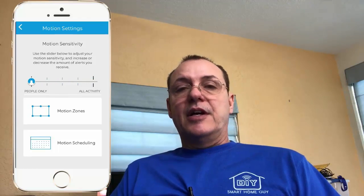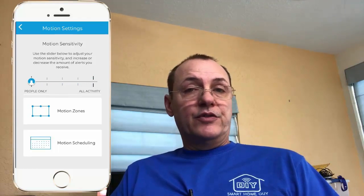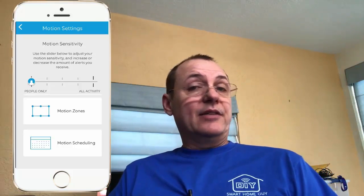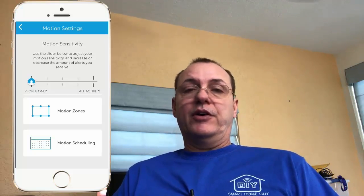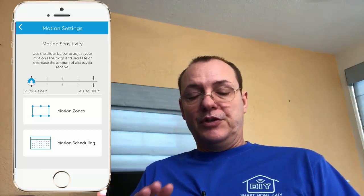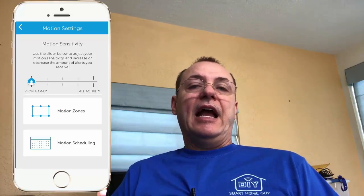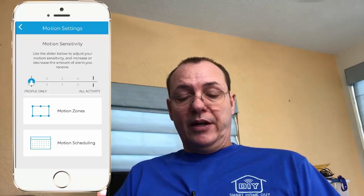Now we'll set this up on people only. I can tell you that this is very sensitive. I've set it on people only, and that seems to actually detect people only very well. The all activity setting just goes bonkers. Motion is going all the time. Get a leaf going in front of the doorbell, anything. That was driving me crazy. So set it on people only. I experimented with all levels of the settings and I found that people only was really the way to go.